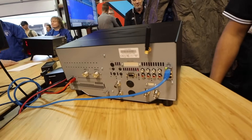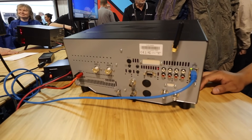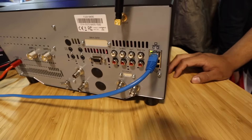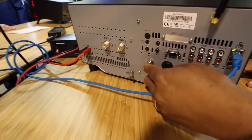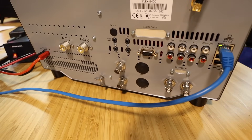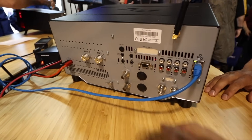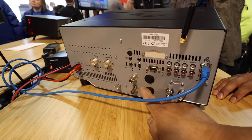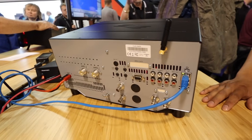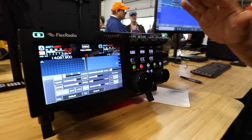With a third-party amplifier, what port would you use for sampling? If it's an external sampler, you would run the sampling input to another port, like one of the receive ports. We have a transverter A and a receive-only port. You would transmit out of the high-power ones and run the sampler into one of these ports — either RX-A or transverter A. We're specifically talking about tuning your transmit audio, and we have several tools for that.